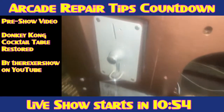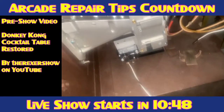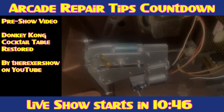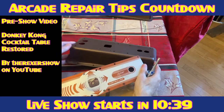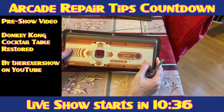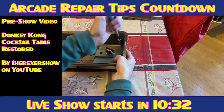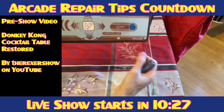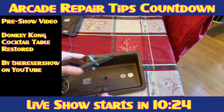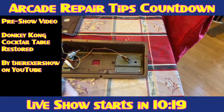Next step would be to add a new coin mech. The one that came with it was beyond repair, and I always like to have a coin mech that works in my arcades. Now you recall the Arkanoid joysticks on player 1 and player 2 sides of the control panels. I would remove these and clean up the control panels, turning them into Donkey Kong control panels. I'd reuse the buttons, clean them up a little bit, change all the micro switches, redo all the wiring harnesses, and then replace both joysticks with reproduction Donkey Kong joysticks.